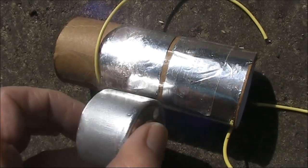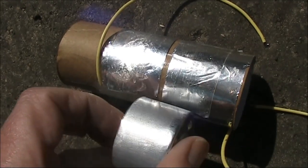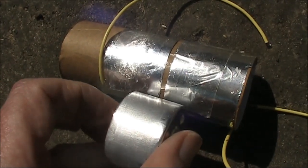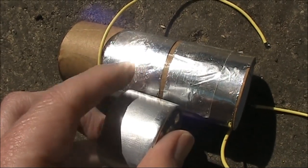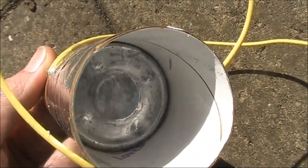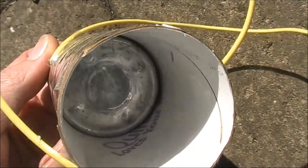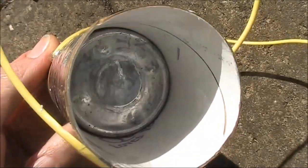The idea is that when you slide the aluminium candle section into the insides of the roll, the capacitance will vary. Minimum capacitance will be here; maximum capacitance will be here — that's where you've got an equal overlap between the top and bottom sections. The snugly fitting candle holder acts as a plunger, and if you wanted to, you could attach some dowelling to make it easier to adjust, or even a screw to give some form of vernier or finer tuning action.